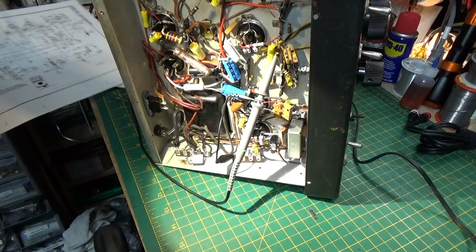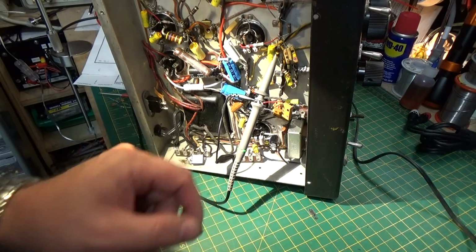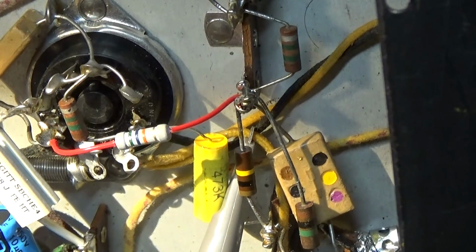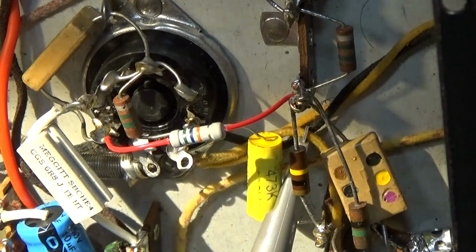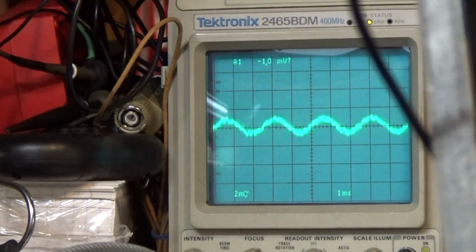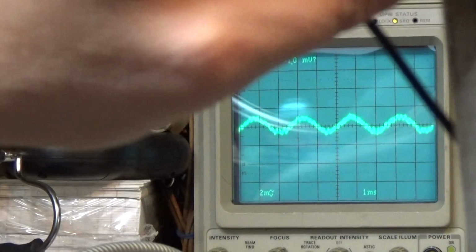Now, mind you, the signal is going to be extraordinarily faint there, so I have to be on a times one probe. And you can see, if you zero in here, this is a good way to do this if you have the test equipment. You can see I'm just clipped on the insulation. I'm not even touching the wire, and basically my oscilloscope probe is acting like a mini antenna, and it's picking up the signal. Now, the downside of this is if you look up here at the scope, which I will try to get some things out of the way so you can see, there's about all that my scope can do right there. I mean, I'm pretty much maxed out on the scope. And it's just the way it is.